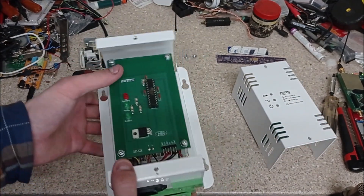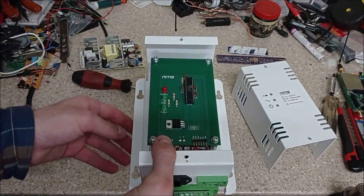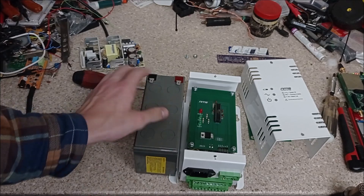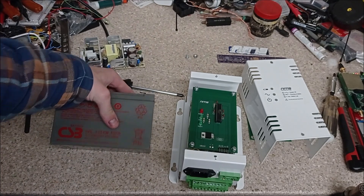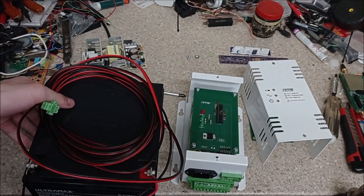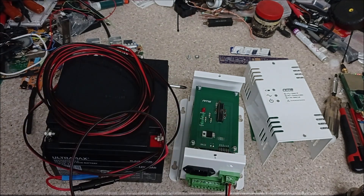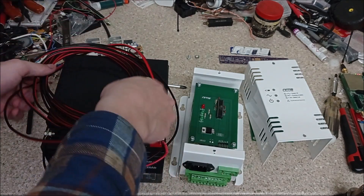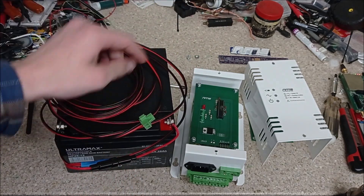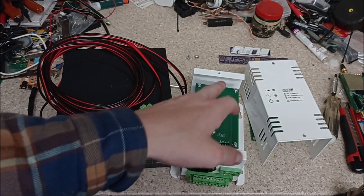You might be thinking: why not make the case slightly bigger and keep a battery inside it? I didn't do that on purpose because it leaves things more flexible. For example, you could use a standard alarm battery like this — it would give you probably a good couple of hours on battery. But because I like to overkill things, I've used this 26 amp hour battery — the connector just goes in there and powers everything. If you're doing this, do make sure to get a fuse and put it right at the output of your battery, so that if anything goes wrong on the cable, the power supply, or any equipment, it will fuse right there and won't burn up your cables or destroy anything.